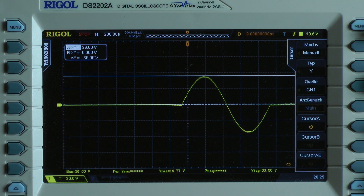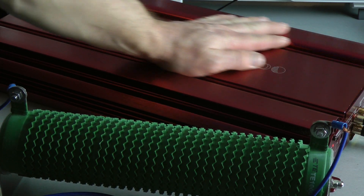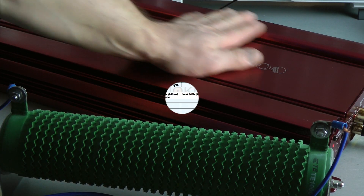I'm a little disappointed because I checked the internet for the specifications of the Orion HCCA 250 and found it should deliver 400 watts into a half ohm per channel — so 800 watts bridged mono into 1 ohm. I don't get any more output power and I don't know why. If you have an idea, please let me know in the comments. After all these tests, the amplifier is just barely warm — I'd say around 25 degrees Celsius.